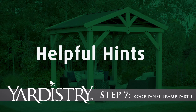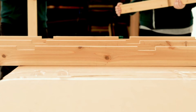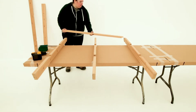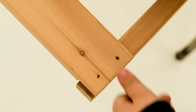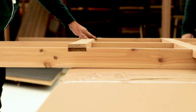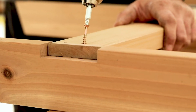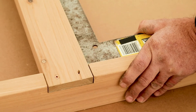Step 7: Roof Panel Frame Part 1. Step 7 should be done on a raised surface that is flat and stable. It is crucial that you keep everything square and flush throughout this step to ensure the roof panels fit properly. Lay down the first three rafters so the notches face up. Position a strap short so that it fits into the notches at the bottom of the panel. If the end of the strap doesn't fit in the groove on the outside rafter, rotate it so it is flushed to the outside edge of the outside rafter and the end with the short notch is centered on the third rafter. Place a strap long, then another strap short in the same manner. Make sure the assembly is square as you pre-drill the holes along the bottom of the rafters using the pilot holes in the strap short as a guide. The holes on the third rafter should be drilled at an angle. Next, secure all the straps. Don't forget to check that each joint is square before securing and to follow the pilot holes.